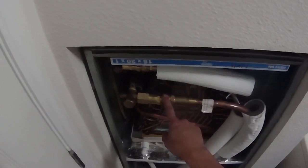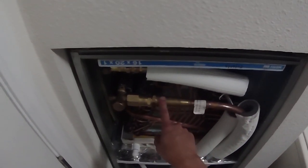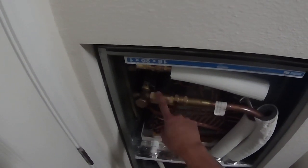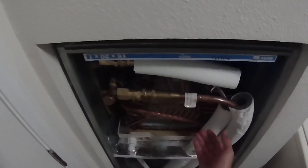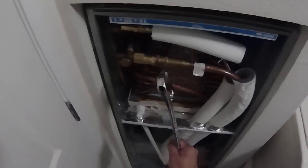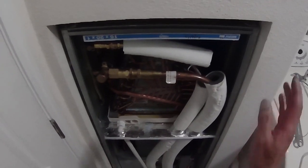Mr. Cool uses connections that make this a completely DIY operation. There's a hose with a big nut, and an adapter you screw onto the end — underneath the cap is a valve that releases the gases. These have to be carefully tightened to prevent gas from escaping. A mistake I've seen in other videos is tightening with just a regular wrench and it leaks out. If it leaks, you'll have to call an HVAC tech to recharge the system, which costs around $700.